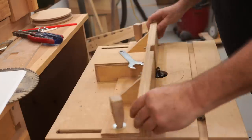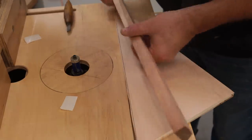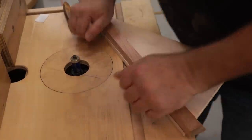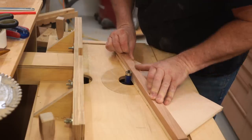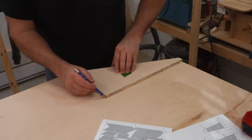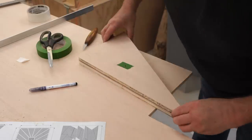The ceiling is actually physically bigger than a full sheet of plywood, but there are spaces between the parts — a one-inch gap, at least that's what I planned for. I figured the best way to cut these parts is to start by laying them out, then cut them fairly roughly with the jigsaw, and then use straight edges stuck to the parts with double-sided tape and a router bit with a bearing on the end that rubs against the straight edge to cut a clean edge. When I have one made, I can use it to mark out and guide trimming the next part. I had all these laid out and numbered on my cut sheet, so I was careful to mark the parts as I was making them. I started by marking on a piece of tape, but later changed to marking the number directly on the back.